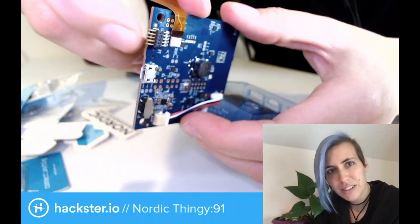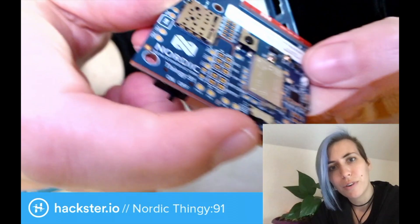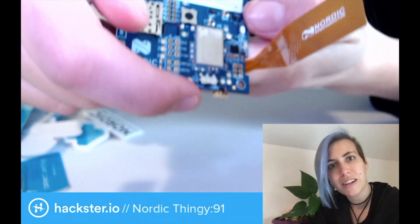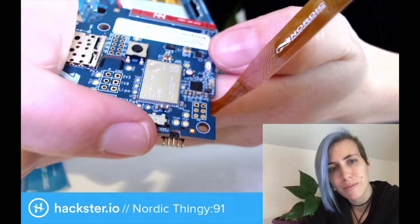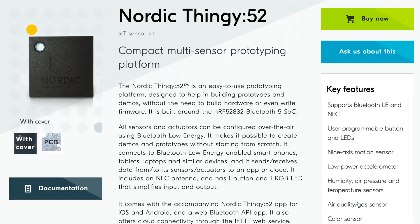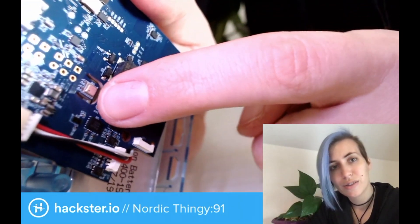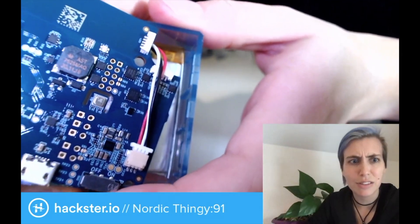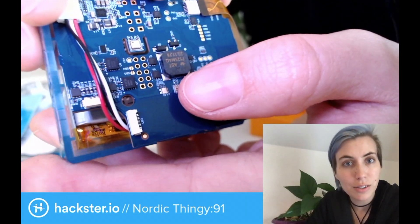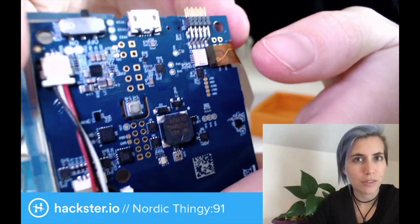Look! The battery is just nested beautifully in there. Over here is a debug connector for external debugging. You've got your micro-USB port for charging that battery, and your on-off switch. This first switch that I pointed out before is not an on-off switch — that one is actually for switching between the NRF91 and the NRF52. So I guess this may be a single development board that they're using for both of them. The NRF52 is an earlier kit that uses a different chip that goes only over Bluetooth Low Energy, so this is sort of the cellular version of that. You also have the buzzer for user alerts. Here is an air sensor — from that you get temperature, air quality, humidity, and air pressure. With temperature and air pressure you could get altitude as well. Next to the buzzer you also have a light level and color sensor for determining if your package has been opened, for example. You have some programmable LEDs, and on this board you also have four MOSFETs for driving things like stepper motors.